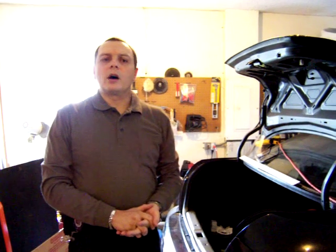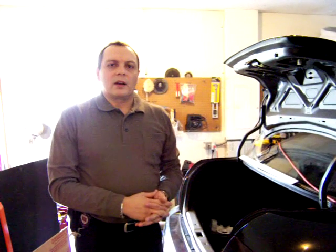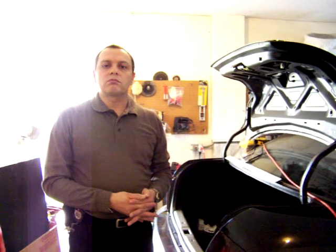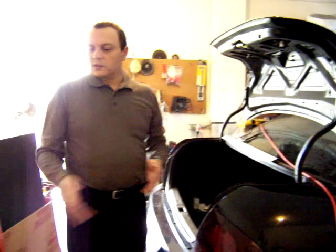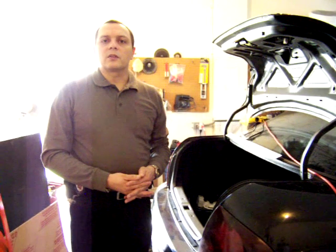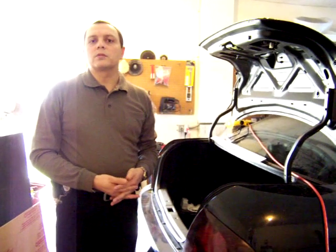I received a lot of comments and questions about how to make an EV conversion cheaper and easier. I'm doing a lot of optional things and using a lot of batteries — when you use fewer batteries, you save money, and cheaper controllers save money too. It all depends on the car you buy; a car with a bad motor will be cheaper. Another tip is to find an already-converted electric car where the batteries or some components are bad and they sell it very cheap. You can find these on EVamerica.com or on eBay — that's another way to get a cheap electric car that you can then improve or fix.